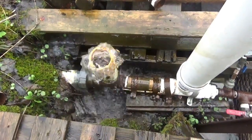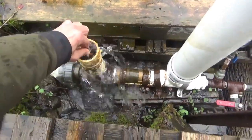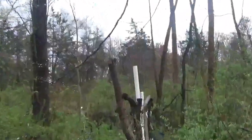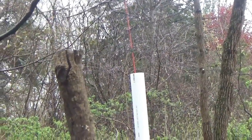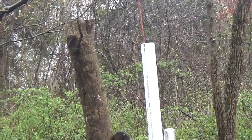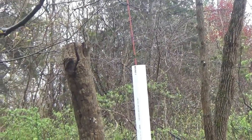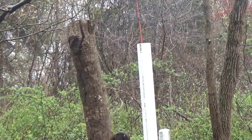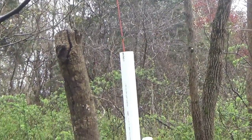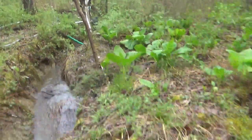See the difference in strokes. We might have some air bubbles in there too. See the float jumping up and down a little bit — there's an air bubble coming out. That's why that float indicator is so handy on a standpipe. You can know what's going on right away by what that float's doing: how much water you actually have, if you've got a clog, all sorts of stuff just at a glance. Very handy.